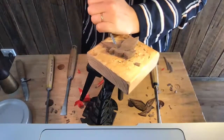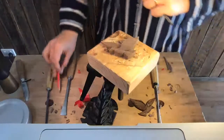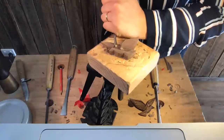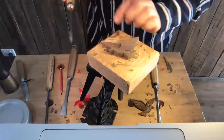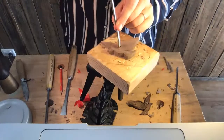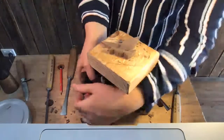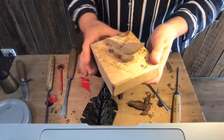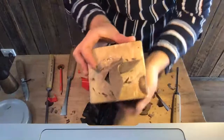Now you can see I'm kind of 45 degrees to that grain direction there — I might draw this side as well for you. That's my grain direction. I've just got a few rough bits — ignore those for the time being. Cut those off, coming straight down and in there. Now I'll flip. This is a lot easier to do from the other side, but today I'm doing a bit of stretching so you guys can hopefully see this little thing we're carving. I've dropped the height of that about halfway.